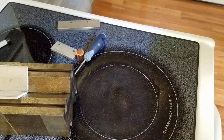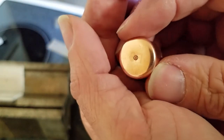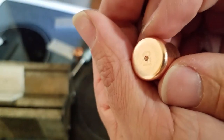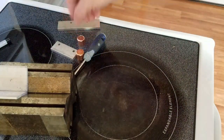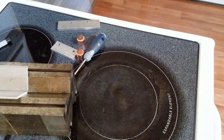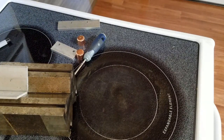I'm pretty satisfied with that one. It would be better if you had proper machinery like in a machine shop, but I think these are going to work fine. There's a nice little indentation for the drill bit. First I'm going to drill these 1/16th inch for the pilot hole, then drill them out to the proper size for the 4-40 tap — I believe that's a number 43 drill bit; I'll overlay text on the video if that's wrong. Then I'll move to the drill press for drilling and tapping.